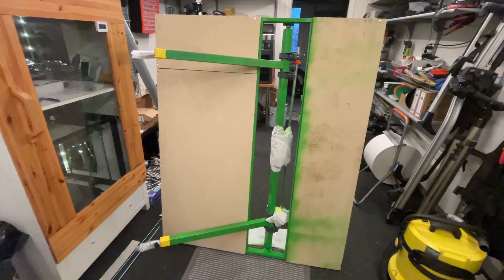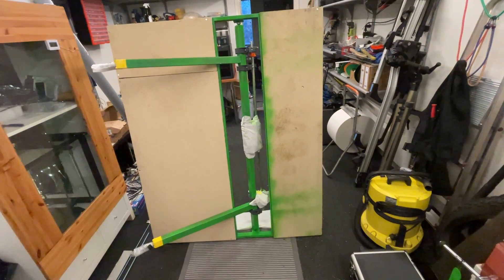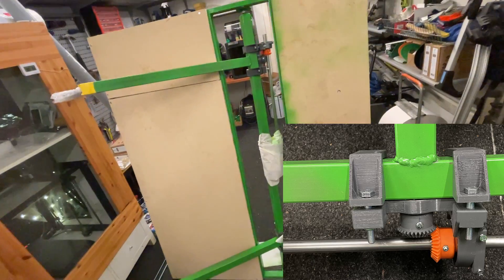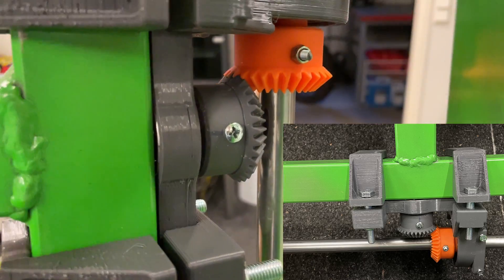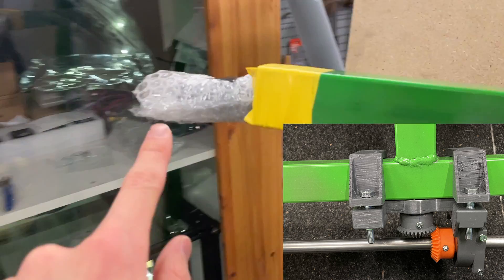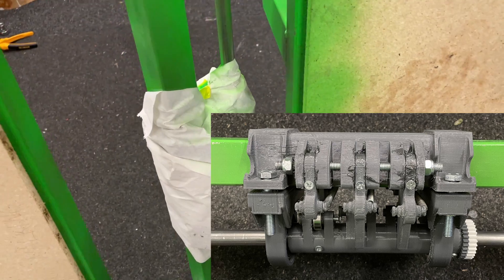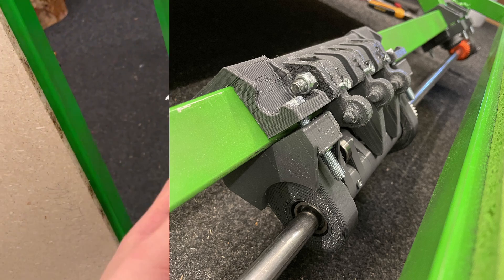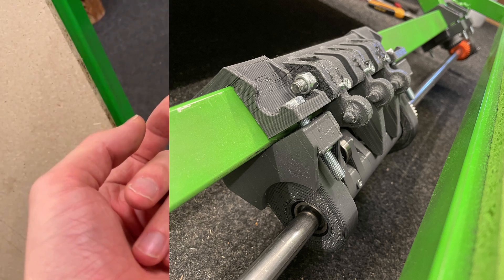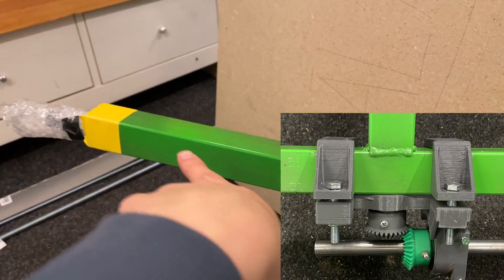They are pretty perfect — I can move the captain side and the first officer side moves exactly in sync. It's really nicely tuned. You can see the gears go in here, connected over here, and from here it transmits to this one and goes through. Here is the centering mechanism, and there is also the Hall-effect potentiometer. It continues over to the other side — exactly the same — and that's all done. It works fantastically.